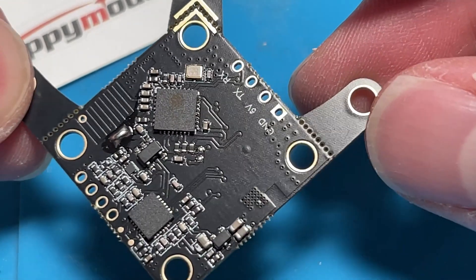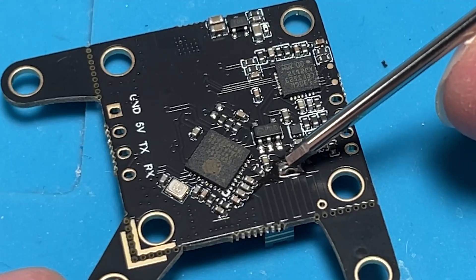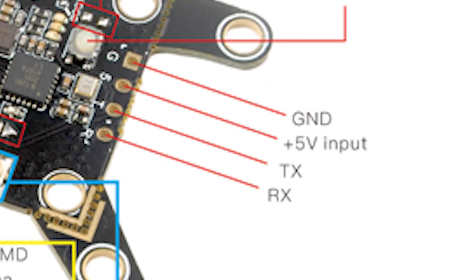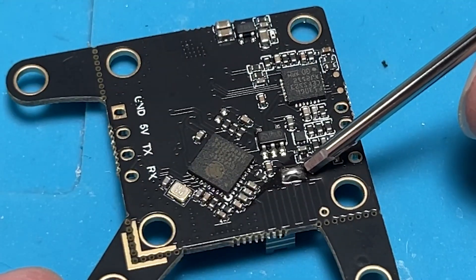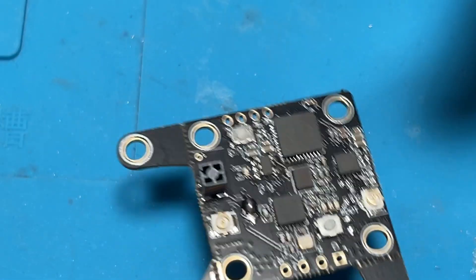As we take a look at the underside of the board I want to talk power. This board takes five volts of input and there's this solder bridge that powers both the receiver and the transmitter. All you need to do is solder one of the five volts and grounds on either side of the board — it comes bridged and it saves you a little bit of time. But if you don't want this you can desolder it. Most of you will probably leave this bridge because unless you have a reason to give separate power sources there's no reason to touch this.